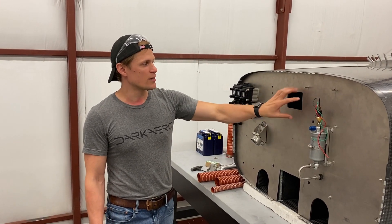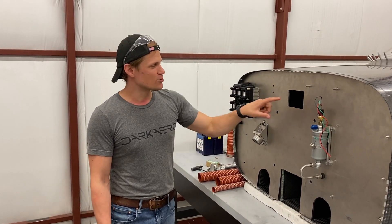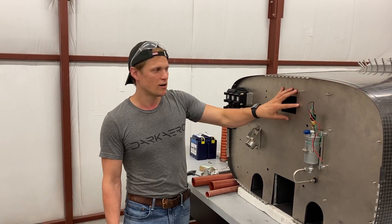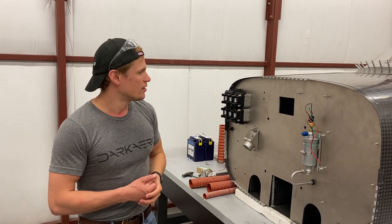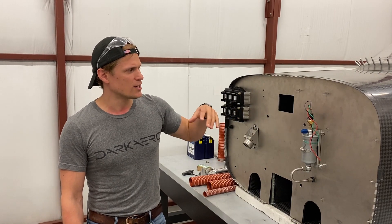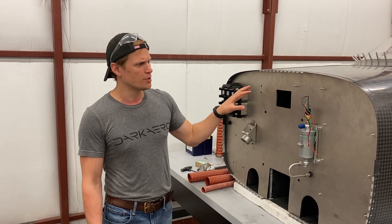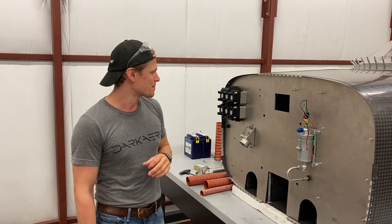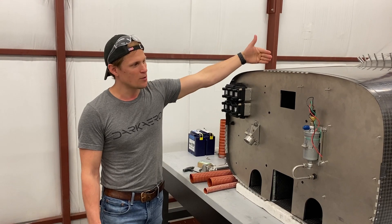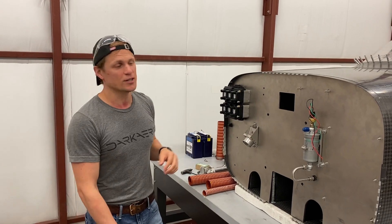The work I have left to do is install a couple of nut plates for this opening where all the wires feed through from the engine into the avionics, then get that cover fitted up. When we get into production, this component will be CNC cut — laser, water jet, or plasma — so builders won't have to go through the effort of cutting titanium like I did. I also did more work on the cold side of the firewall installing fasteners and nut plates — let's take a trip into the cabin to check that out.